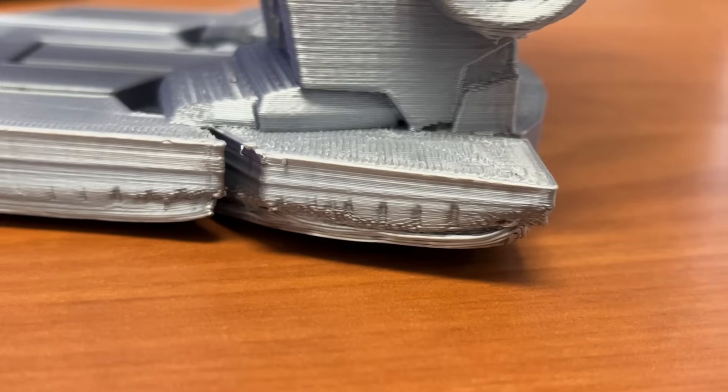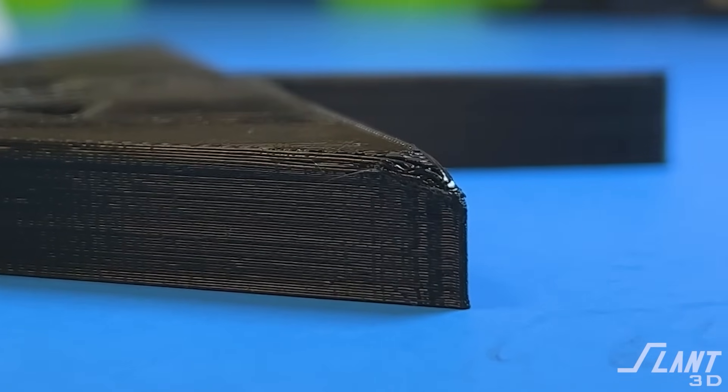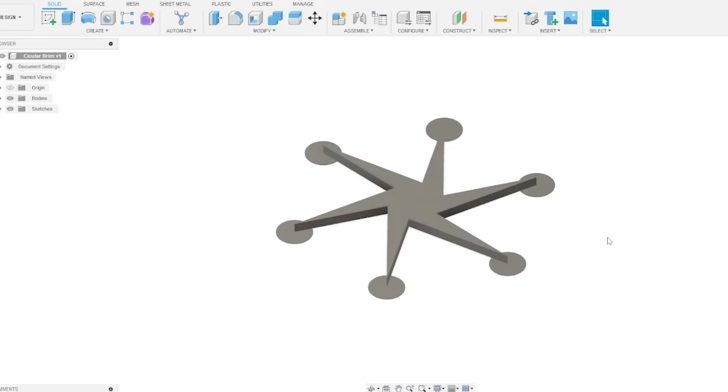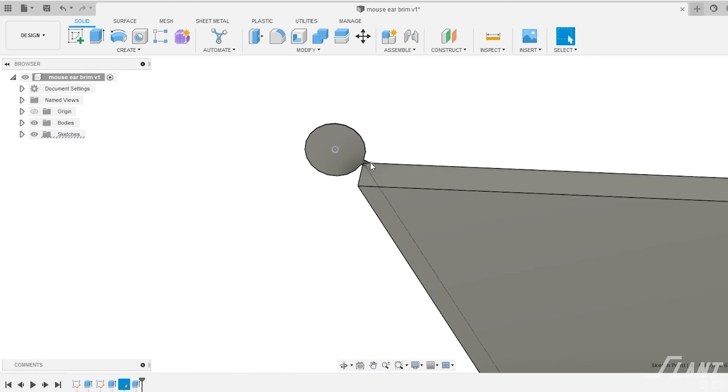Warp can be a huge issue even with simple materials like PLA. If you have a big long square part with sharp edges, those edges can pull and shrink and warp up. You don't want to turn on a brim or raft in the slicer or set temperatures just right — you want it to be reliable. The easiest way to design this into CAD so it'll work everywhere is to use mouse ears. If you have a sharp corner, put a small circle over that corner and it is held down with more surface area to adhere to the bed. Those brims can be easily removed and if you're clever, you can design the mouse ears so they just barely touch the corners so they can be snipped off clean.